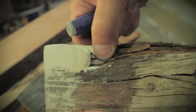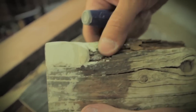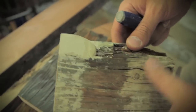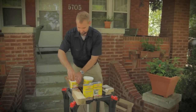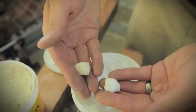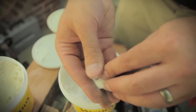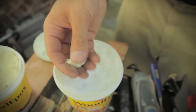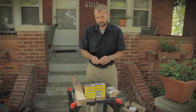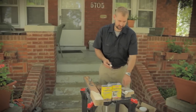Here's a piece that I've applied the consolidant to previously. You can see where the brown area is soft and flaking off, and over here where the wood is darker is where I've applied the consolidant — it's much harder and stiffer. This white blob you see is epoxy from the same system, also a two-part product. The idea is you take equal-sized balls of the two different products and work them together to form a cohesive paste. I like Abatron for when there is a large gap to fill or if I'm trying to rebuild a particular piece of wood that's been lost, but there are others that work better as a skim coat when you're just trying to fill in gaps like the checked face.